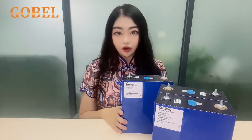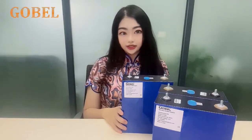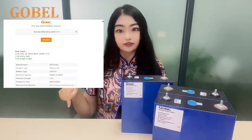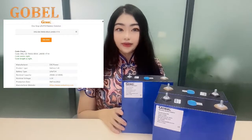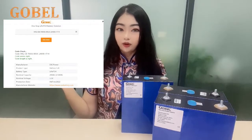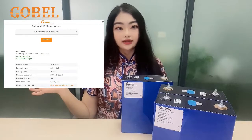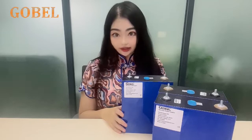About checking the QR codes, there are two systems for B-Mark cells and non-B-Mark cells. I will link below for your references. And here is an example of B-Mark cell check results, showing it is produced in March this year, which is quite new.